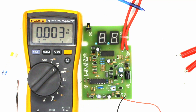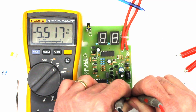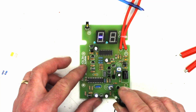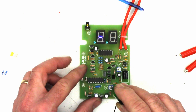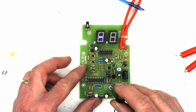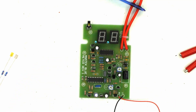So these are the instructions to adjust the low battery warning fully clockwise. Just to verify voltage, I'll get the Fluke meter out and we'll test right here at the circuit board connections. I have 5.517 volts — I don't know if I could get it much closer than that. Next we turn the meter on and we slowly adjust this down until we see a B begin flashing. Right there. So next I'm going to go ahead and get it back in the case, get it assembled, and we'll test a couple capacitors with it.